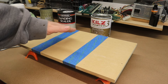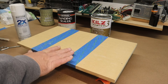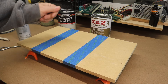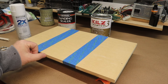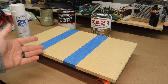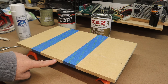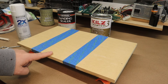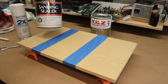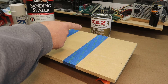What I like to do is give it a coat of primer, let it dry — it takes about an hour or so — and then sand it down with about 600 grit, just enough to knock down any rough surface. What the primer does, especially along the edge, is lock in those wood fibers so when you go to sand it you're not trying to take the primer off, you're just smoothing it out. Hitting it with 600 grit smooths out those standing wood fibers and gives you a nice smooth finish.